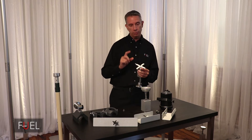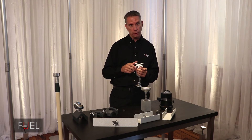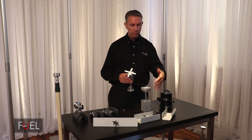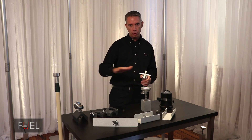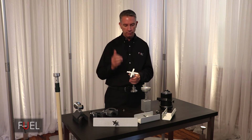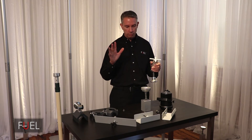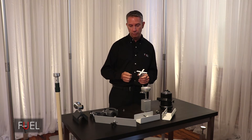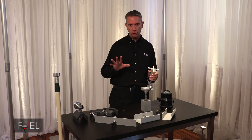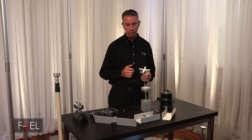Drop ceilings are the most complicated to connect onto. Airwall tracks are the second. We have one other clamp coming out — a circle clamp designed for aluminum tents that have tracks. More traditional piping or square tubes are very possible and very fast. But we wanted to give you a total solution. We have the ability to focus the head right up to seconds before the doors open. We can install onto drop ceilings and remove. We can work in corporate hotels smoothly and efficiently with just one person or multiple techs. For a massive event, they can still handle four fixtures at a time — click, click, click, click — four fixtures snapping on, 30 seconds later connected to the track. No lifts, no ladders. You can get 50 fixtures in the air in probably about 15 to 20 minutes. It's unprecedented.